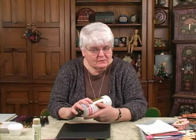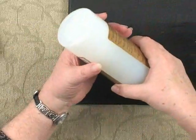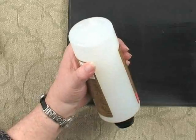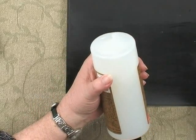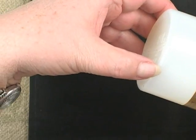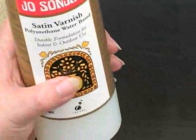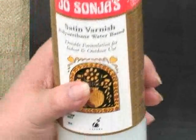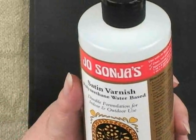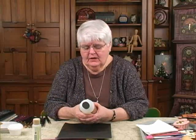Say you haven't painted for a year — as many of you haven't — and then you go and get this bottle of varnish, and there's maybe a half inch, three-eighths to a half inch bit of gunk at the bottom. Right there where it's starting — this is a bottle of varnish with the older label and it's satin. Satin means there'll be more matting agent in it than gloss, and then there's a matte that has a lot of matting agent in it.